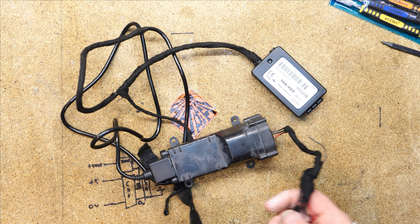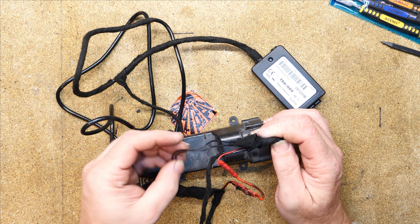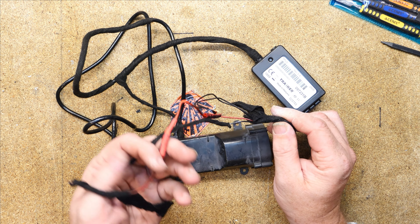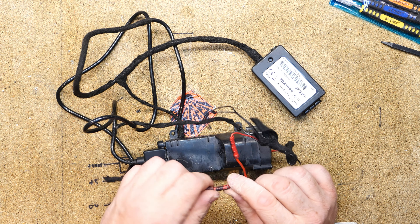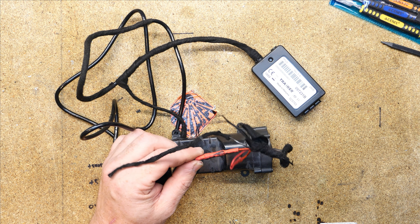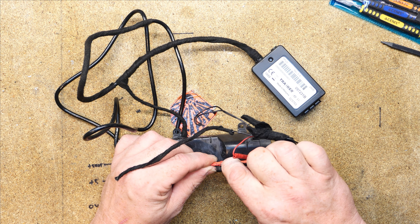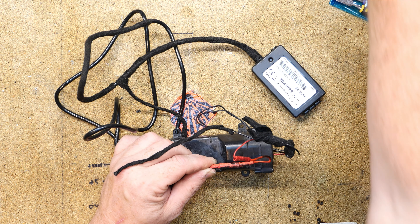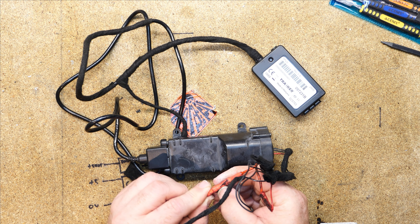This was wired into the vehicle underneath the dashboard and we have what is quite obviously a ground supply and a power supply. Instantly this was wired straight into a 40-amp circuit without any fusing, but that looks like a really bodgy type fuse arrangement in there. Let's just slice into that. I reckon that is possibly a soldered 25mm fuse.